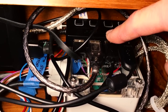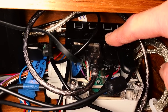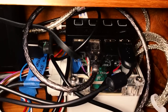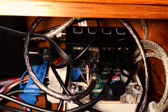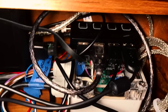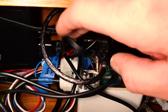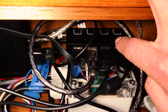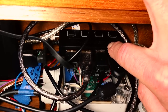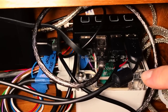It's really important to look for a powered USB hub. If you overpower your Raspberry Pi by plugging in too many USB devices, you'll get a lightning bolt symbol in the top right corner, meaning the Pi isn't getting enough power. With a powered hub, anything you plug into it is powered by its own independent power source at 5 volts. You can plug the hub into one of the Pi's USB ports and still have three free ports available.